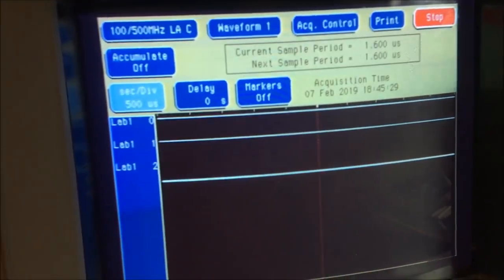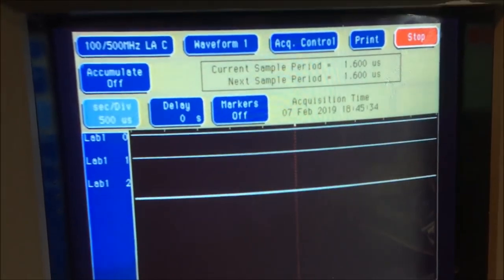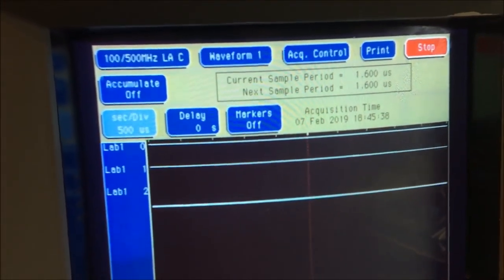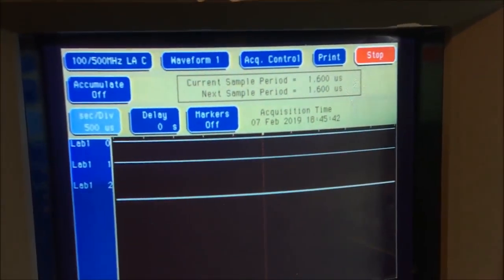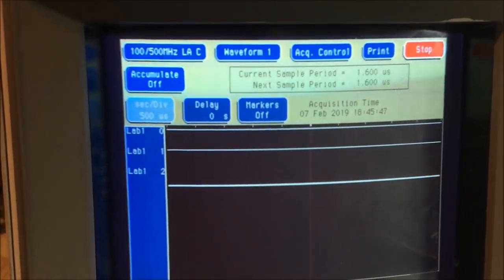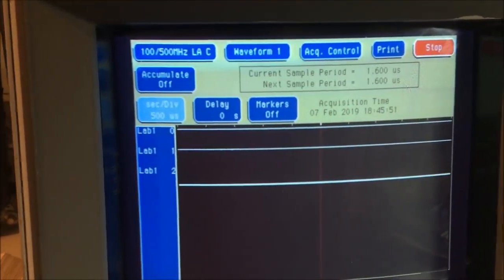I mean, it could very well be that this is the way it's designed. I don't know. But this is curious to me. Why have two high lines going to an LS86 just to create a low? Why not just tie it to ground?